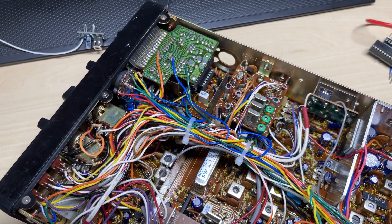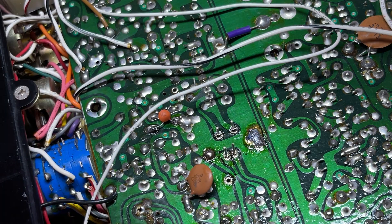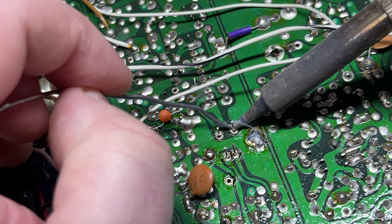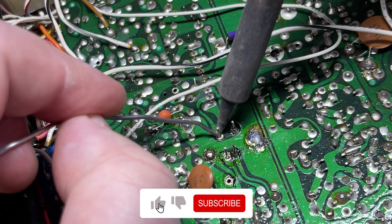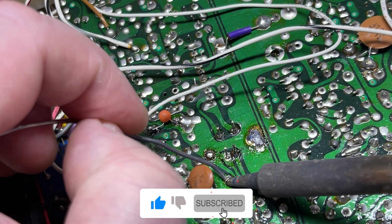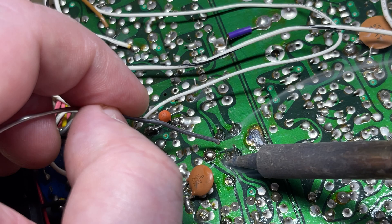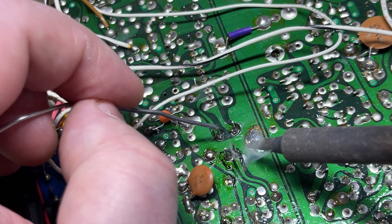We'll take out the VCO that I put in — that's been working well over the last few weeks. There's our voltage feed VCO put in place. We're going to tuck the wire into that wiring loom and drop it around the back of the board. As you can see, there's only 4 points to solder now. We'll have to cover that hole up. The VCO should work exactly as the other one did, but we've got a stable 5V supply going to it.